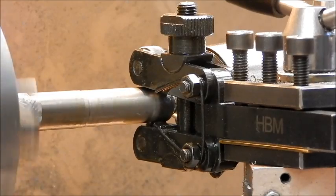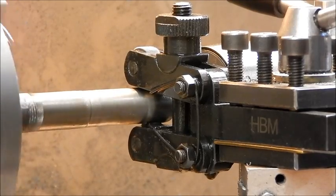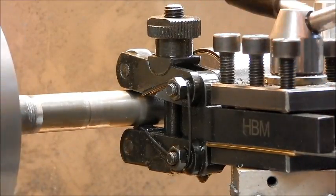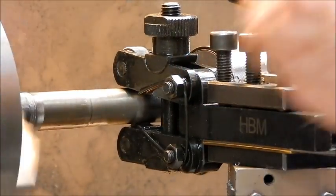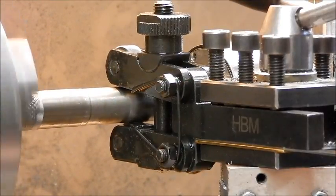Your feed is your coarsest feed — a coarse feed at about 140 RPM. Basically it rolls onto the job the same as if you were screwing on a clamp. You don't have to screw the clamp down; you just roll the knurl into the job and it will climb onto the job. Then you just feed it across as you want to.